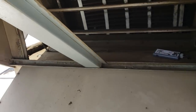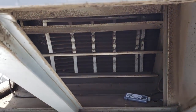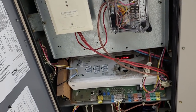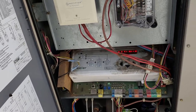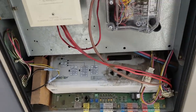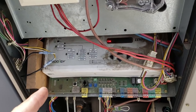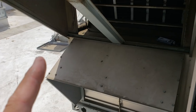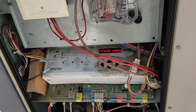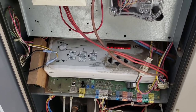I noticed my outdoor air dampers are jammed open and those filters are plugged solid — these outdoor air dampers have been open for a very long time. Going through the Prodigy board, I find that the economizer was never installed. These economizers sometimes come shipped loose and you have to program them in the Prodigy controller. If you don't program them right, they just sit there blank. But what's confusing me is: if the economizer was never installed, why is the damper totally open? So I go through the process of installing and programming it, start it back up, and nothing happens.